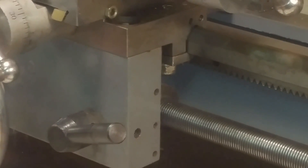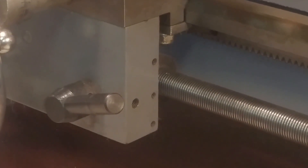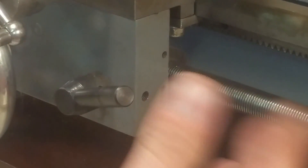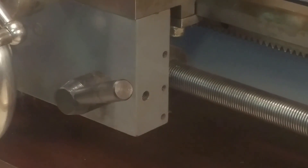These three screws — there is a trapezoidal piece of key stock that looks like an angle. It sits behind these screws, and as you tighten this up it will tighten the screws. You can typically leave this just snug tight, and you can adjust these after the fact, just so there's not a whole lot of play in there.